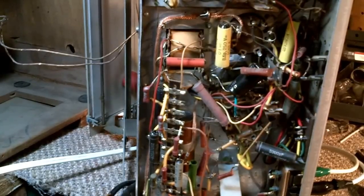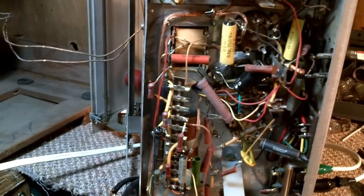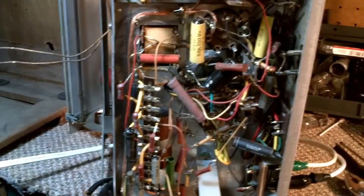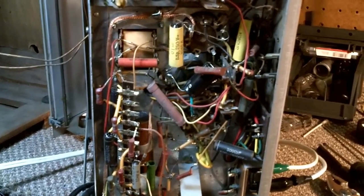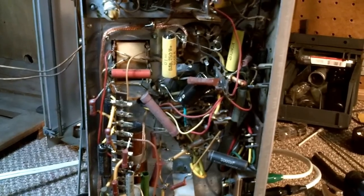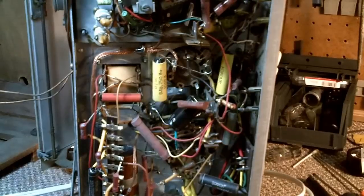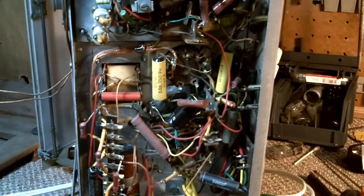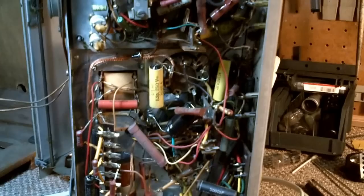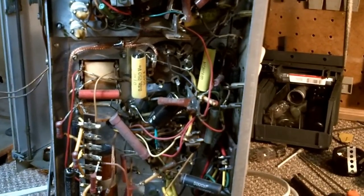Still doing lots of funny things, isn't it? Static crashes. It almost sounds like those mica caps you find in IFs that tend to give trouble on some radios. But I have no idea what's inside the IFs on this one. Still stumped, and an unsatisfactory result from that antenna test too.